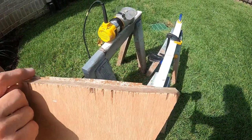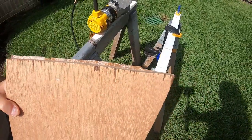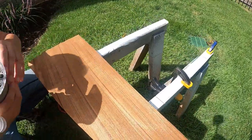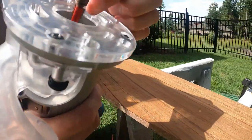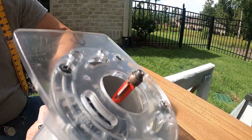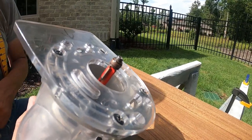Hanging over the 3/4 inch marine ply, and we're going to trim that off using a router today. So that goes like that. The router bit has a bearing that'll follow along the plywood, and the cutter will then actually cut the veneer, making the whole thing nice and smooth. So with that, I'm going to clamp it down, plug it in, and we'll start.